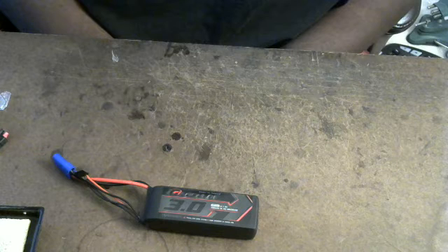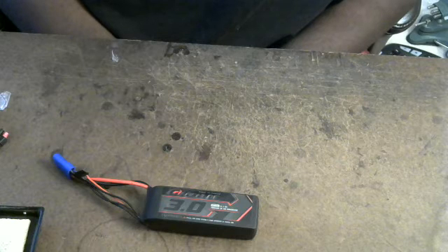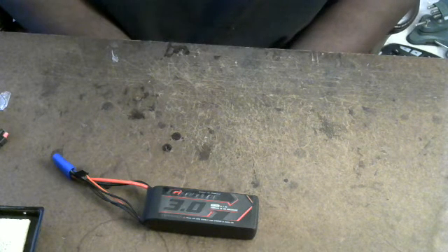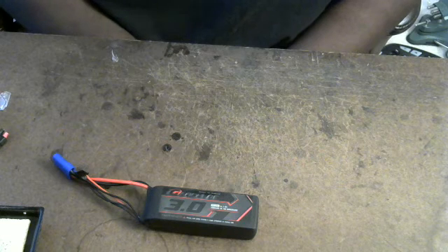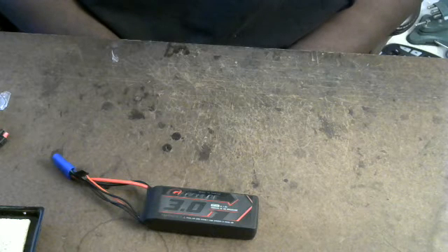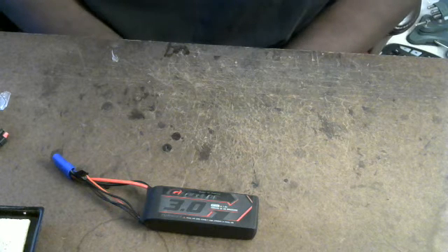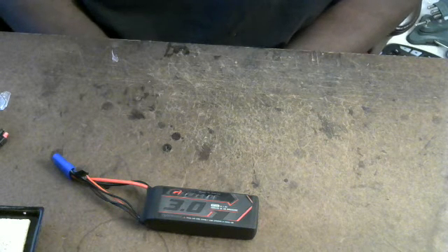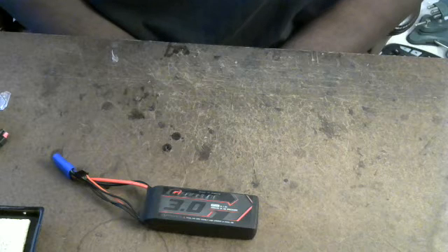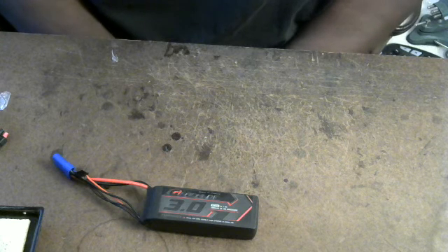After the 15C and 20C discharge, something was clearly going wrong. Especially when I saw that rainbow curve where it sunk like a rock, recovered a little bit, and then sunk again. It didn't give anywhere near full capacity — I think it was giving about 2,200 mAh at that point, because it was discharging to the lowest cell. Once that lowest cell hits 3 volts, it cuts the discharge.